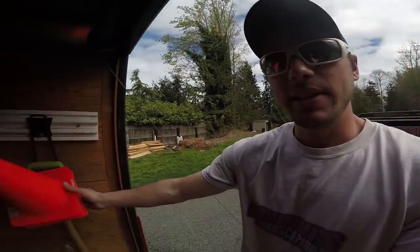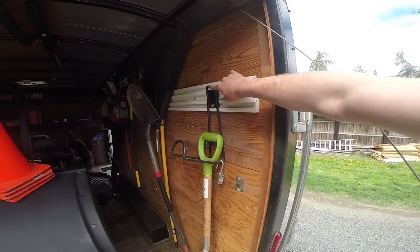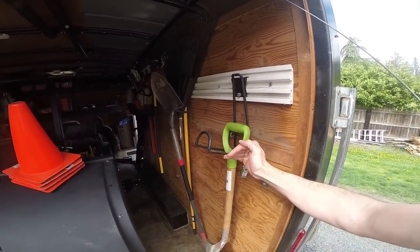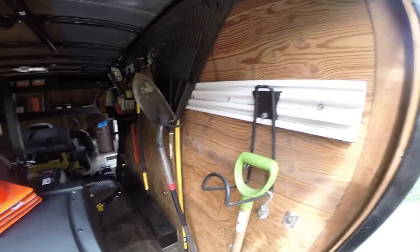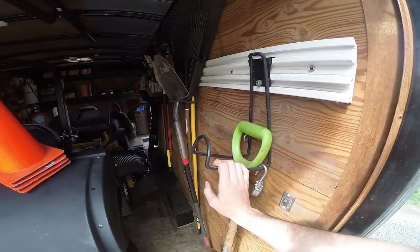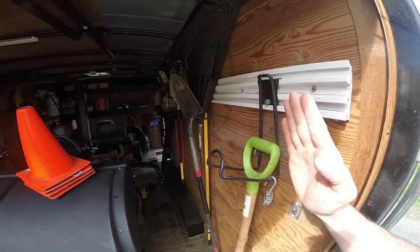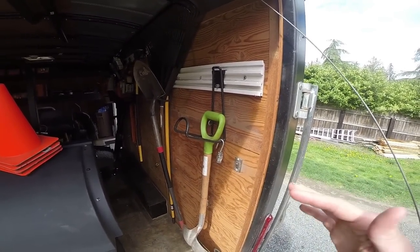Before you go, one more tip: for the racks, we first screwed the self-tapping screws into the hangers, then attached them to the racks — that prevented a lot of the stuff from falling. Another issue was that the hooks on the racks weren't at a steep enough angle, so things were falling off pretty easily. For all the racks holding tools — like the ones for backpack blowers — we actually placed them in a vise and bent them back to a greater angle so they hold things back off the wall and prevent equipment from falling.